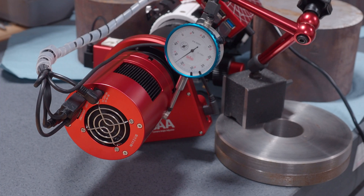Let's go back to zero once more. This time I'm going to go half a degree — rotate. Then another half degree, and there's the other half degree. Then we'll go back half a degree. You can see there's about five thousandths of backlash — that's kind of what I was looking at there. I'll have to review the video because I'm not terribly closely paying attention to what the dials are doing.